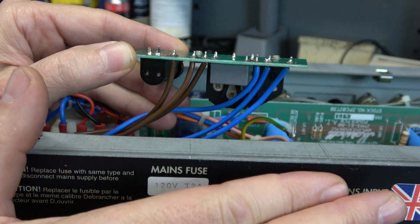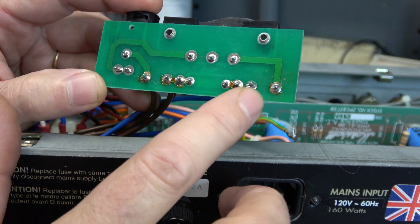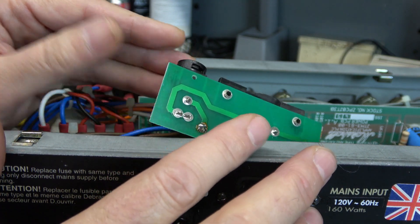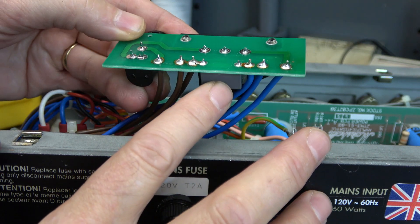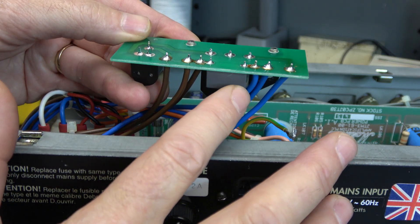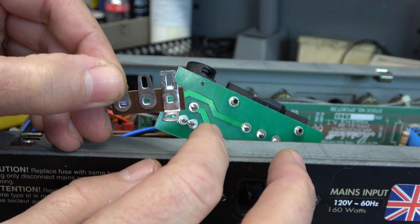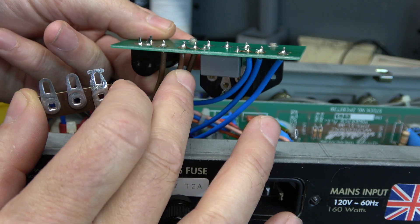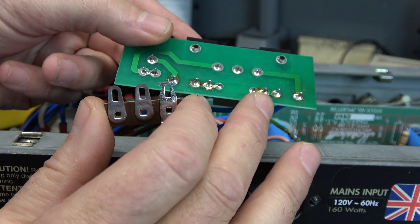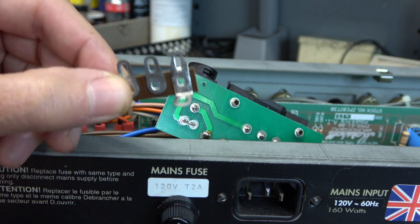Why do you have four more wires? Kind of a mystery. There are these two blues and two browns and if you take a close look you'll see they're all connected together. What's in between these wires? There's a capacitor, and I traced that out and it goes back to the power switch. So they've put this capacitor here for convenience since the AC switching was coming back here anyway. We're going to have to mount this capacitor on the chassis. What I've elected to do is take this little terminal board and mount it on the chassis behind the outlet, and swing these additional two browns and two blues and that cap down onto this little terminal board to take care of that functionality — because obviously I cannot mount this capacitor on our new fuse holder or AC input jack. So we've got to land it somewhere. Time to mount a terminal board.